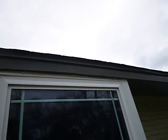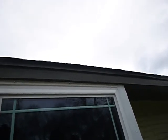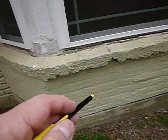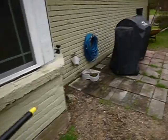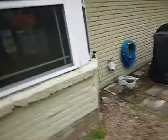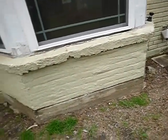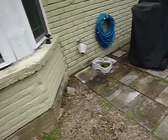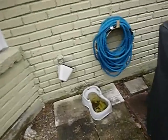Water has tensile strength — it can curl back three inches, like how mosquitoes can walk on water. The water rolling off this roof is curling back down here, sitting against the structure and ruining the mortar. We've got lousy drainage in this area. A rain gutter could correct some of that drainage, otherwise this damage will repeat itself.